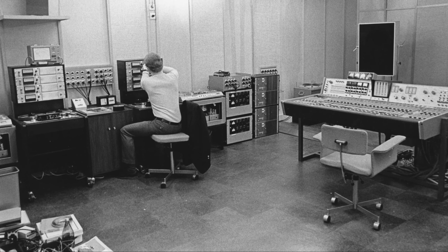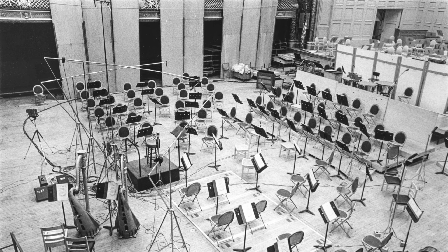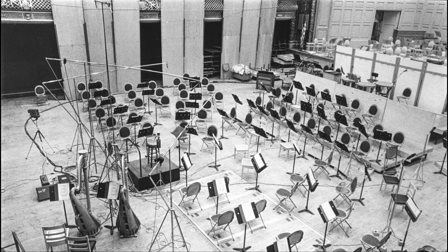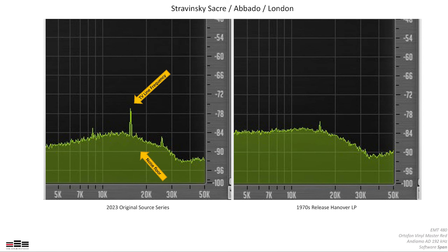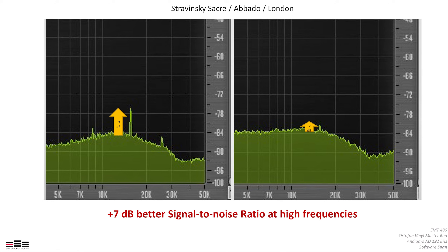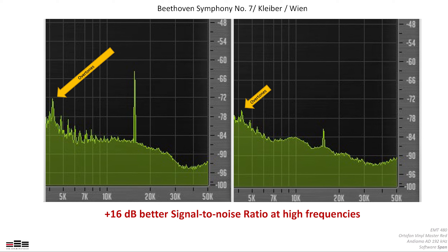On the very left you can also see a television camera, used for visual contact between the concert hall and the control room where the recording team was sitting. As the TV camera was an analog device at this time, running with 25 pictures and 625 lines per second, it made a tiny noise — almost inaudible for our ears. When playing a very quiet passage where there is no music, we can still see the television line frequency in the spectrum in the old version as well as the new one. The interesting thing is that the ratio of this noise to the noise floor is different, meaning we have much more high-frequency information on the new version, and at the same time much less background noise.